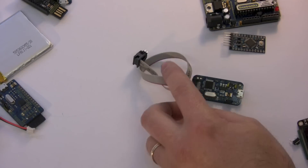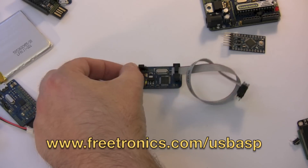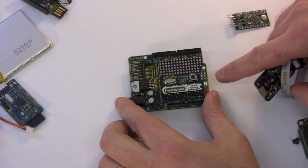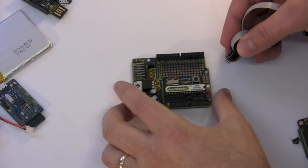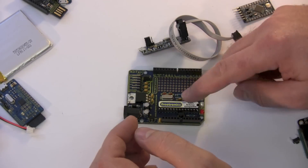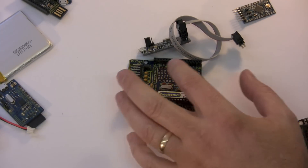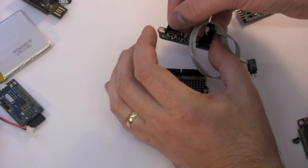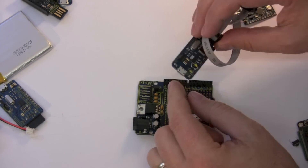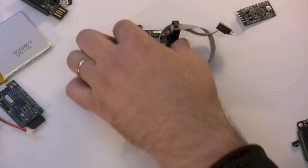The next device is a USB ASP compatible programmer. What this lets you do is plug USB in here and this plugs into the ISP port on your Arduino — in the case of the Kitten, for example, it's here. That's a standard location now for all Arduinos since revision 3. That lets you do things like reflash the bootloader on the MCU, load programs without using the IDE, and load programs that overwrite the bootloader area to give you use of more memory. We've made this voltage selectable — it will work with either 3.3 or 5 volt targets and will power the target from here. I've had to make a couple of cuts and fixes on this, so there'll be some slight revisions going into production, but it'll be out very soon.